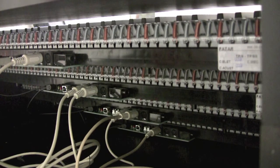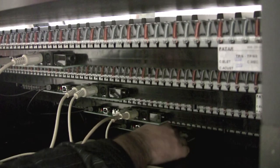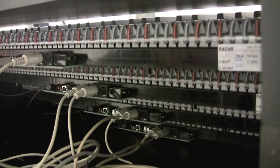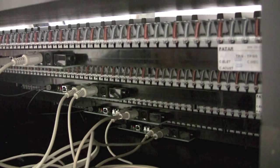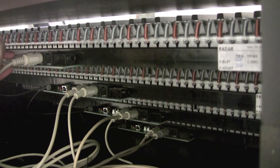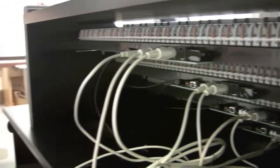So once you plug the USB into the top manual, you need to create the final feedback loop from the lowest manual. And that's by plugging a cable from the lowest manual, MIDI out, to the top manual, MIDI in. So once you've done that, you can load up CMK Config and the loop will be there so that the software can recognize and program the keyboards.